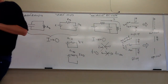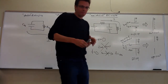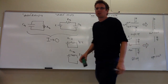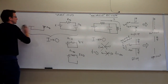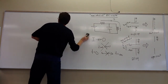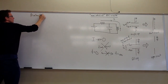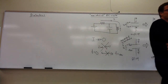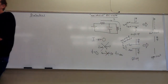For non-standard circuits, you can't find what's happening at specific intermediate times, but you can analyze t = 0 where the capacitor is often empty and acts like a short, and you can analyze what happens after a long time when the capacitor is as full as it's going to get and nothing more happens. Next: dielectrics — the way to improve the performance of a capacitor.